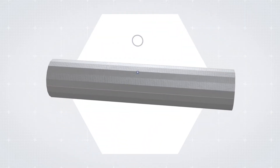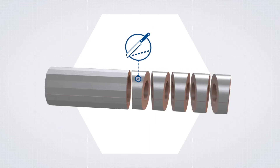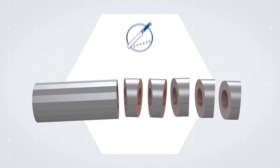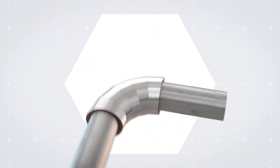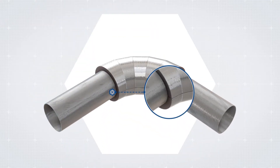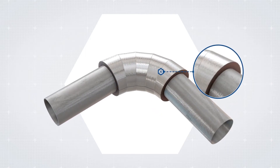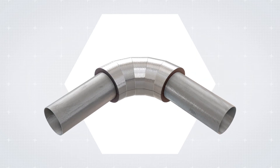For circular bends, you must cut the slotted rigid insulation into mitered segments. The width of each segment will vary according to the duct bend, and a correct width ensures good contact with the duct surface. Ensure careful placement of each segment for a proper fit with no gaps in the joints.